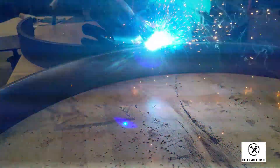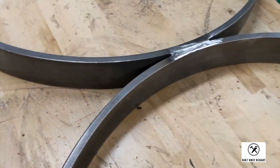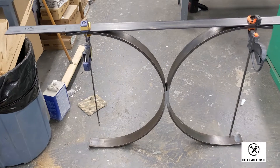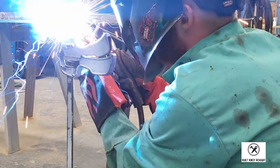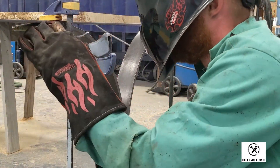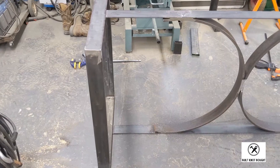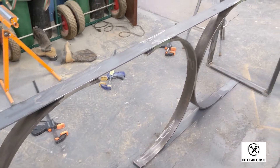Then I progressed on to laying actual beads. Off camera, I ground all my beads flat on the faces of these curves — not because I didn't like the welds, but because I wanted a really clean look in the end. Up next, I ran equal-length stretchers across the top and bottom, held them together with clamps, and tacked all those in place, finishing them all with solid beads as well. Off camera I also welded up two rectangular end pieces out of rectangular tubing to cap off each end of this table base.